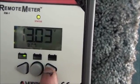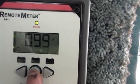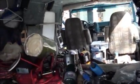Battery bank two I just hooked up a couple hours ago — 13.04 volts — and I've only picked up 3.8 amp-hours in the brief time it's been connected. Those numbers aren't hard and fast. When I put a load on the system, the voltage is a bit more realistic — it actually goes down to a more reasonable 12.6 to 12.7 volts. So I just wanted to show you guys that setup. My van is a mess because for the last two days I've been tearing things apart and setting this system up.